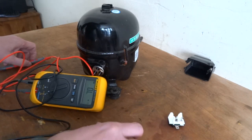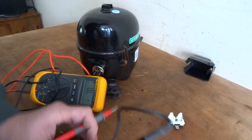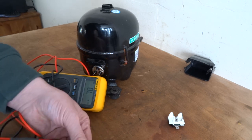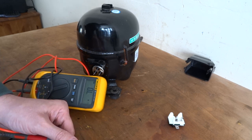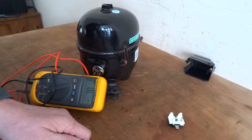There are all sorts of different ones of these as well, but on this one you just push the leads in and you should get like a 5 ohm reading — which I'm not getting. So obviously this one's gone faulty.